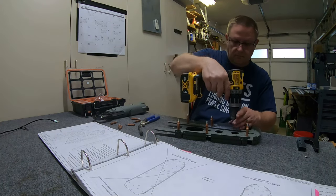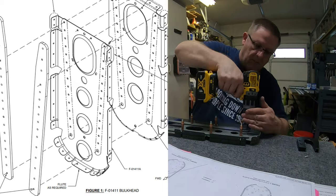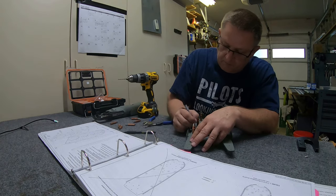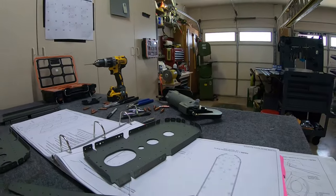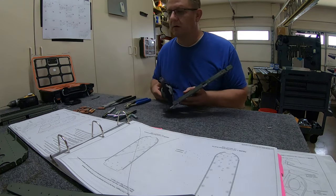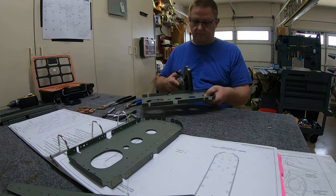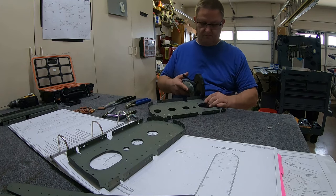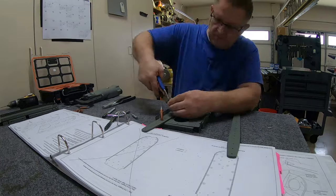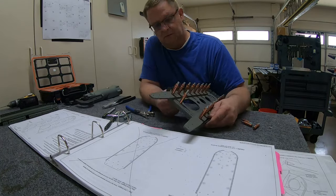This is the second section of the aft fuselage bulkheads — it's not the very back but it's the second one from the back. It's the furthest back part where the horizontal stabilizer attaches. Those two big metal pieces that get attached to it are for the horizontal stabilizer. You'll eventually set the horizontal stabilizer on the deck of the aft fuselage and match-drill the holes from the big thick pieces you'll see here in a second into the aft fuselage. Those big thick pieces and the parts that stick up are what actually get bolted to your horizontal stabilizer.